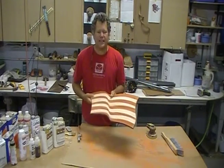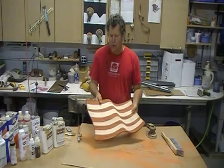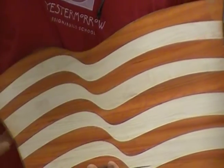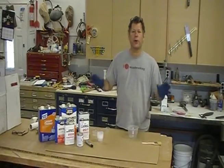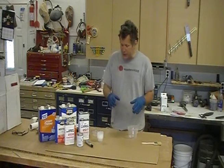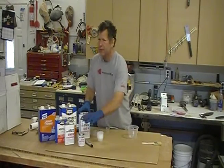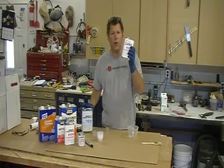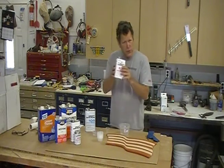I just ran this through the planer. It took a lot of that stain out, although you can see there are some deep stains, which means that epoxy really went deep in. I had to take a good 1/16th of an inch off, so now we're down to 3/8 inch, but that's okay for a cheese board. I'll give this a coat with the West System and see how that goes. Make sure you read the mixing instructions, because West System and a lot of epoxies mix with different ratios. The West System 207 is 3-to-1; the 206 is 5-to-1 — that's a common mistake. I like to write the ratio right on the can. That means three parts resin and one part hardener. I like to use the 207, which is a special crystal clear so it won't yellow the wood at all.